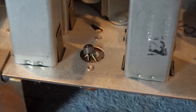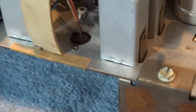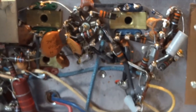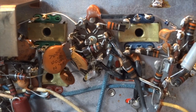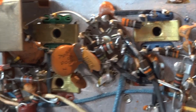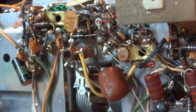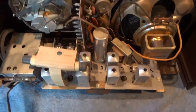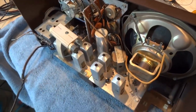Here's a transistor, and if you look very carefully, you can see Motorola was very creative in the fact that they're using 7-pin miniature tube sockets to serve as transistor sockets. Here's a look underneath. The pins just go right through the tube pin holes in the socket and they soldered it right in place, then used the remaining pins as terminal lugs. That was an interesting approach to radio construction — I don't think I've ever seen that before.